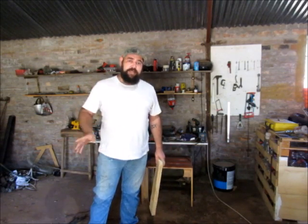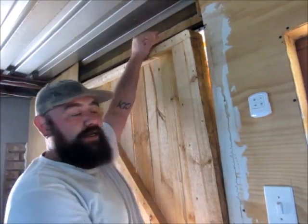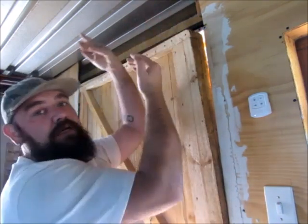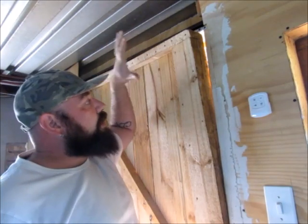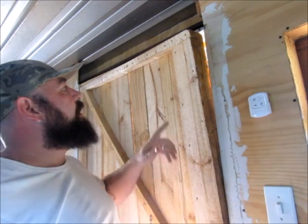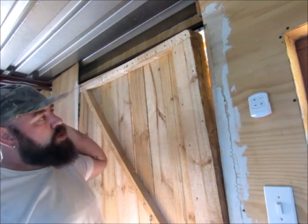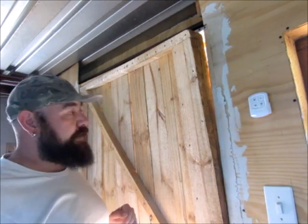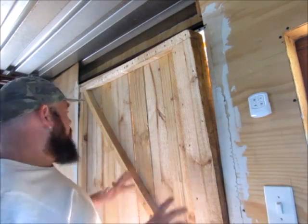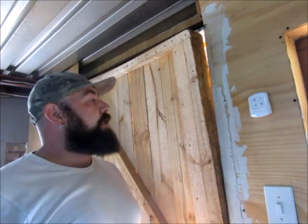Let's get back to the door and I'll show you exactly what I'm talking about. So this is the door that needs assistance. At the bottom the door is lined up and the back is lined up on the hinges, but this piece is pulling out because of the wet wood. The plan is to put a hole here and at the opposite corner, and use that piece of tubing to pull it back straight. So: drill two holes and pull this thing back into straightness.